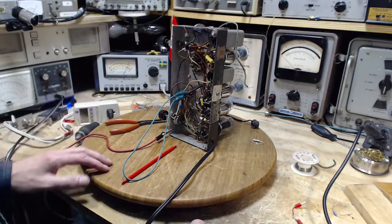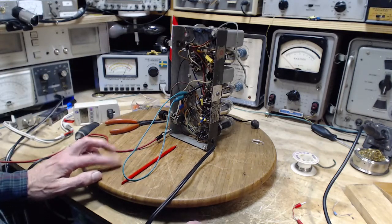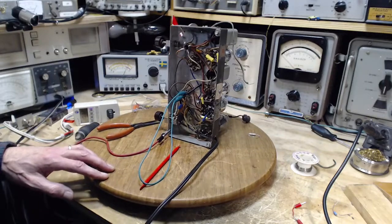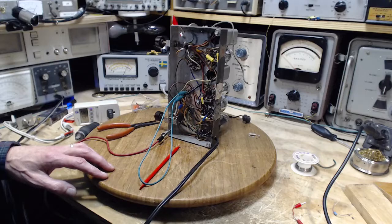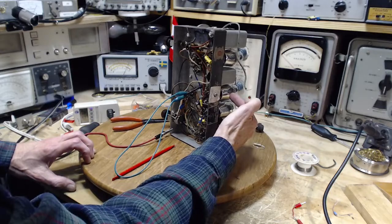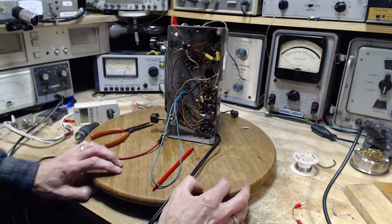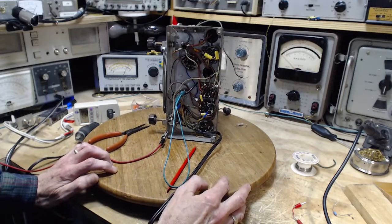Well, I hear the hum. I don't hear the radio anymore. What is it about the cathode? The cathode goes right to ground here, and the ground is dependent on the rivet technique. Now, is that true with this tube? So I'm looking in there, and I don't see such a rivet. And just because I don't see it doesn't mean it isn't there.